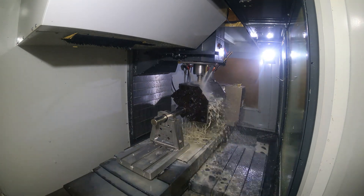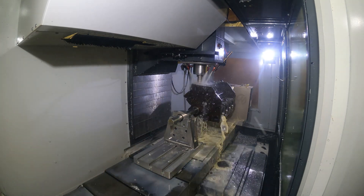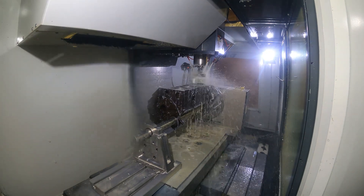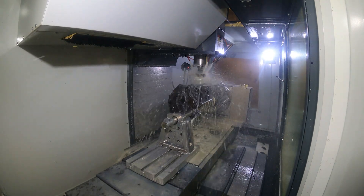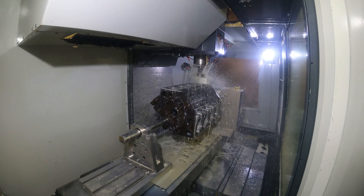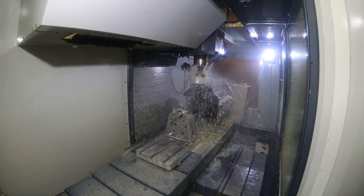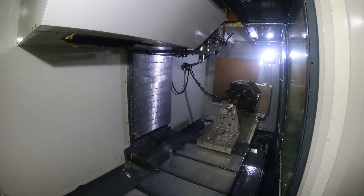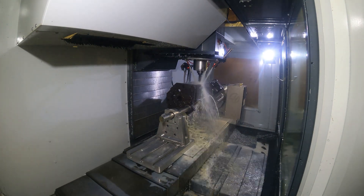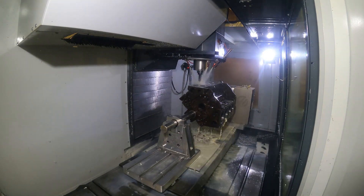And now we're shell milling it. This is a rough milling — we're hogging out. We're zero decking the block so we're going to take it down to 9 inch, cutting about 30 thousandths off just depending on the block. And then this is our finish cutter CBN insert that we're running across it, just taking a finish pass and cleaning up after the shell mill. Then it comes down and checks the deck height with the probe and records that measurement, checks the deck height on the other side and records that measurement.